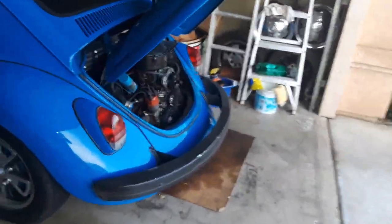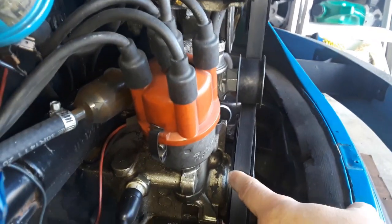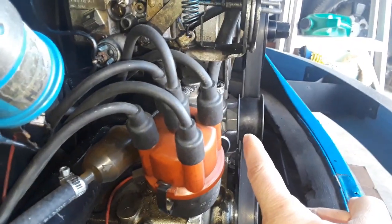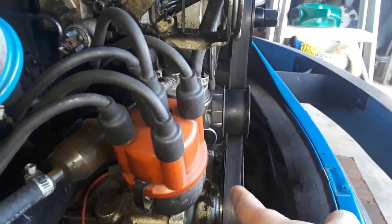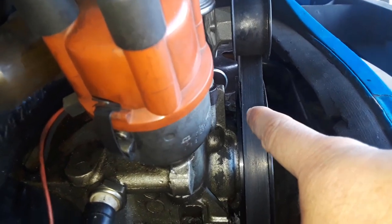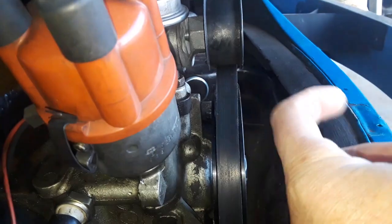Now the blue bug - same deal. I think I have two shims on this pulley and two shims on the upper pulley. On this one I'm not running any shims because if this pulley was working the way it should be, it would be perfectly centered. But you can see it with your own eyes - you can see how this thing is literally going that way.